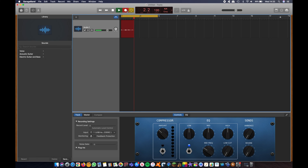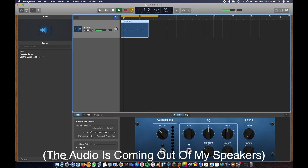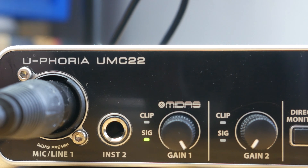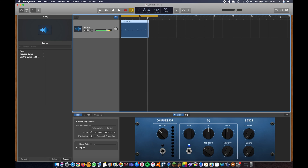Now we can try recording. "Hello, this now should be recording what I am saying." Listening back — that did indeed record, though it was a little quiet. So I can increase the gain on the unit. The lights on the front tell you when it is detecting a signal and also when you are clipping. Turning it up all the way, talking normally does now make it clip, which will not sound good. So you've got to be careful of that — but it's good that it shows you in real time.